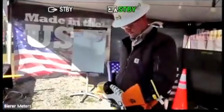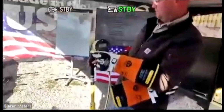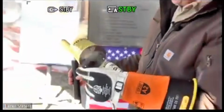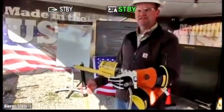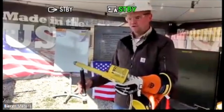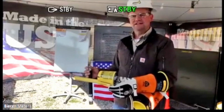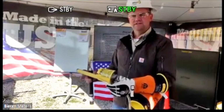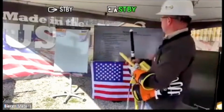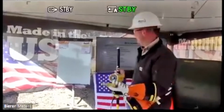So your DC testing, take that handle off. You should see that right there, Ryan. You see that okay? Yeah. All right. So there's roughly your 100-volt power supply. Now this power supply has all these batteries basically stacked inline. They're like little camera batteries in here. So utilizing this adapter with the extremely high resistance, it pulls just microamps. So this adapter will last an extremely long time, essentially the shelf life of the batteries, because there's essentially no current draw whatsoever using extremely high resistance like this tool right here. So that's your DC check. Again, you could check truck batteries, any type of batteries in substations, anywhere you may have batteries.